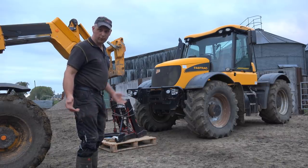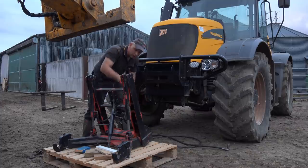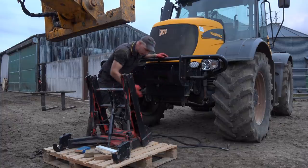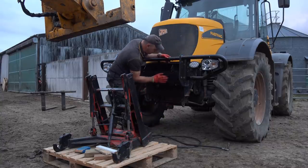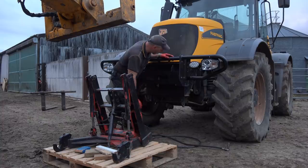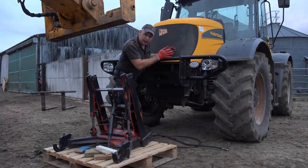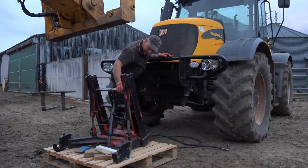Let's offer it up and see how it fits. Now this linkage came with a big frame, probably about five foot long, that bolted on either side — because it was on a Massey Ferguson 6480. I don't need any of that, because the Fast Track is a full frame design, which basically means I've got a chassis all the way forward here, so all of this metalwork here is strong and I can bolt it onto it. Whereas on the Massey, a lot of those have got a stressed engine block — the engine block forms part of the chassis, it's a structural component. Whereas on this, the Cummins 6BT just sits in the chassis; the chassis is where the strength is. Let's get this lifted up and see how it fits.